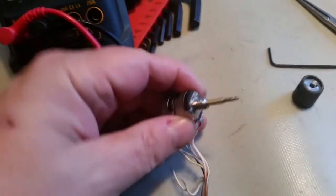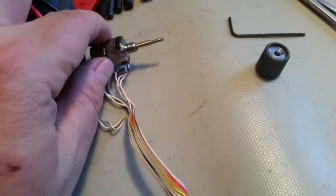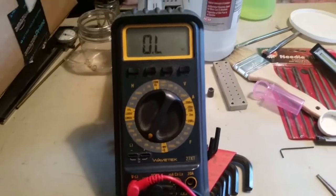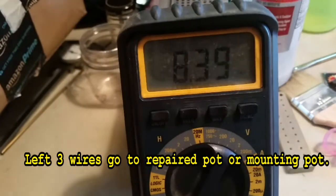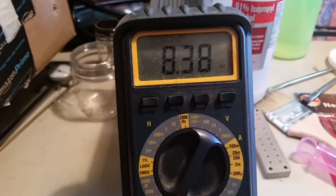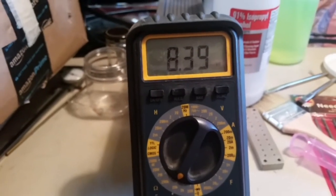Alright guys, I got it all back together here. It's nice and sturdy. What you have to do next is go ahead and pick out your three pins that go to your pot, put your knob on it — it makes it easier to turn — and then use your multimeter and test it. The left three wires are the wires that are for the pot. It goes all the way to one side and that's it. As I go through the transition, it's really smooth now — no dead spots or anything. Fortunately I don't have three hands, so I'll have to show it to you another way. Alright, I got an assistant!